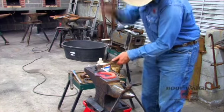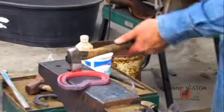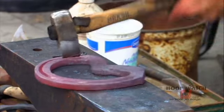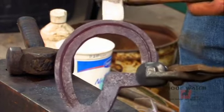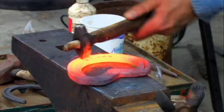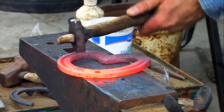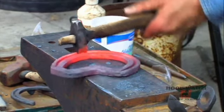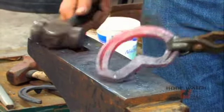So now it's marked, I can go a little bit harder. Now right here, my creaser is a little bit wide for that tight of a radius. You can see how clean it is here, but then when I get up here, it gets a little choppy because the blade is just a little bit wide for that tight of radius. So let me get a smaller creaser. Okay, so this is just a little narrow, kind of specialty creaser for tight radius. Okay, so that cleaned up any hash marks that were left by that wide creaser.